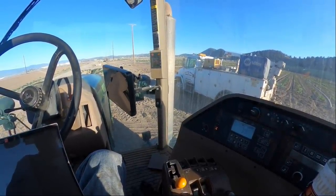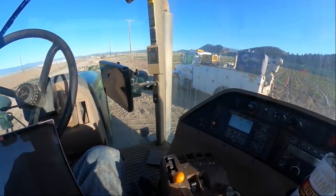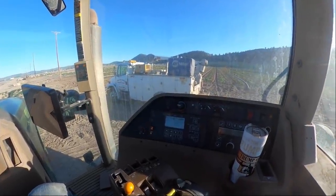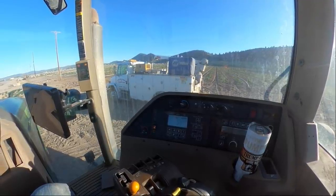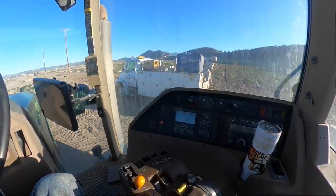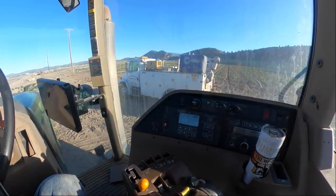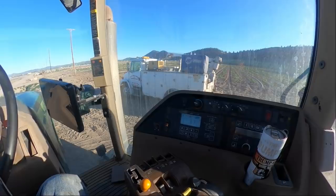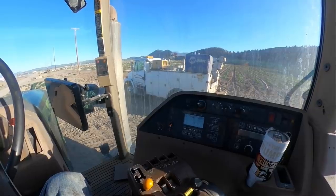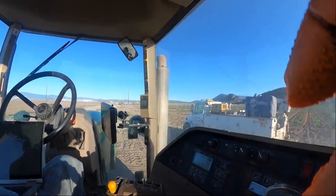Okay, so start the engine and install the diagnostic. We already did that. We're already way ahead of you here. Drive the tractor forward at slow speed and observe the left digit in display. It should read, for straight ahead, XX, 0XX for a left turn, and a 1XX for a right turn. So let's drive it and see what it says.